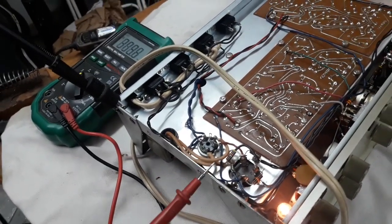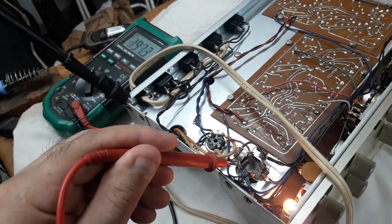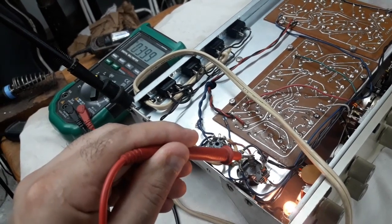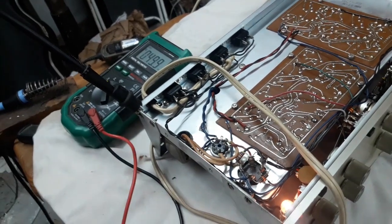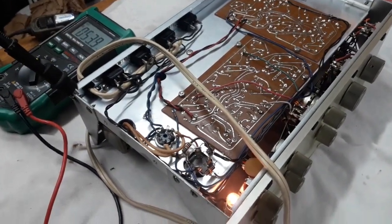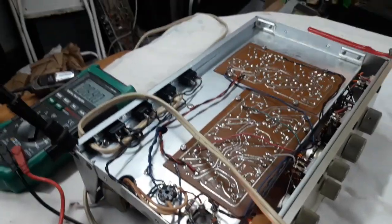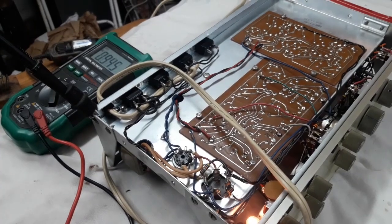So these are a little lower than the diagram indicates. As I said, we should be going from 210 to 405, and here we're going from 197 to 399. So we're kind of like 5 to 10 volts too low. Are we having a problem with the tube rectifier? I don't know. I'm not tempted to change the capacitor just to see if those voltages change with the new capacitor. Right?